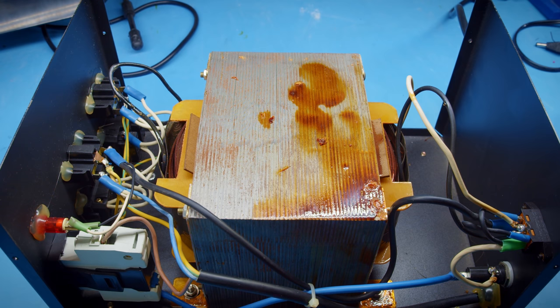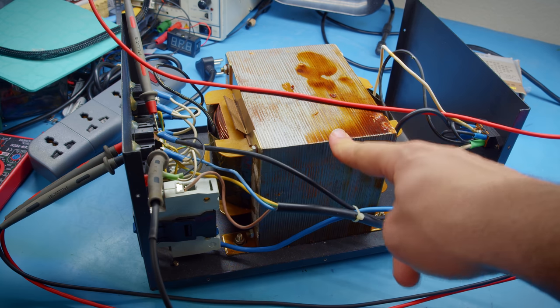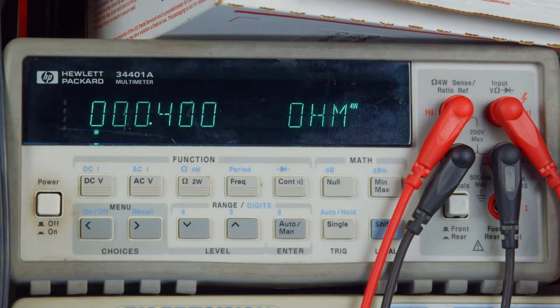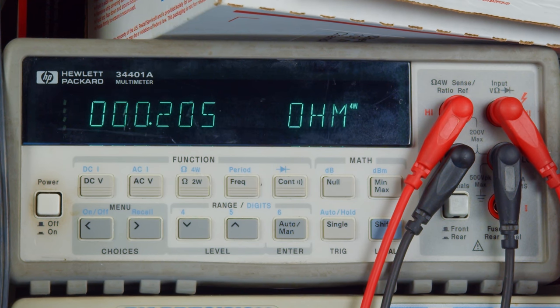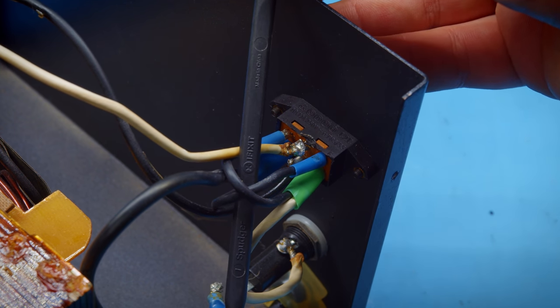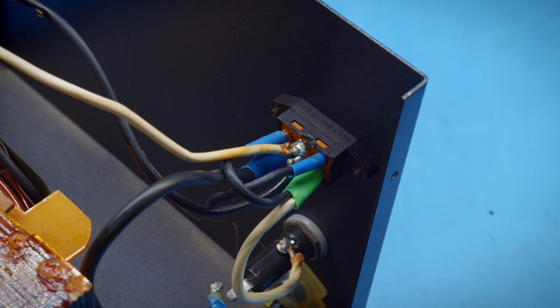This is all just theory and schematics, so let's get back to the real thing and confirm this is how the unit I have works. Even though everything is electrically all connected in here, I can visually confirm the change in the length of the coil going to the outlets by measuring resistance. At the 110 input setting I'm getting about 400 milliohms, but when I switch to the 240 input I get about 200 milliohms, which is the 2-to-1 ratio I would expect to see. That change in resistance confirms that this crossover section is changing the position between the center tap and the outside edge of the coil, telling us how this switches between step-up and step-down. It's really nice to see theory in practice like this.